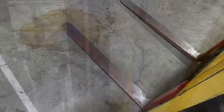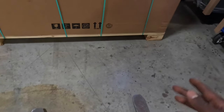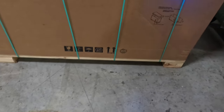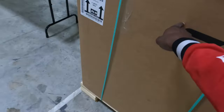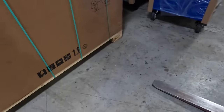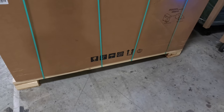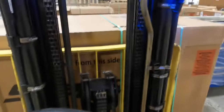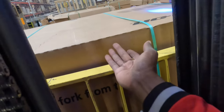When you're picking up a load, you want your forks evenly dispersed on each side so you don't get a tilt this way or that way — evenly dispersed. Most likely one fork goes right here and the other one goes right here. Also, you want to try not to pick it up too high or keep the load elevated while you're driving — square, flushed right in the middle, pallet all the way back to the mast.